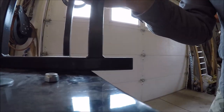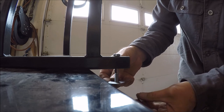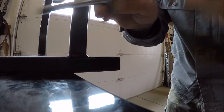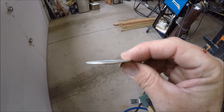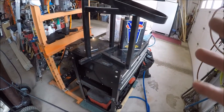Here's what it looked like before. Bolt through the top, washer from the bottom, nut on the bottom, and the floorboard of the trailer right here. It worked well. One issue I had was with these washers - you can see how it deformed them. They're pretty thin, and all of them crushed the wood and bent up inside. But the racks never got loose, never wobbled around, so I was happy with that.